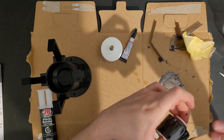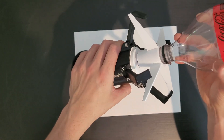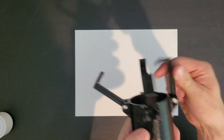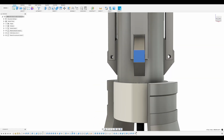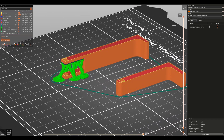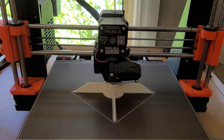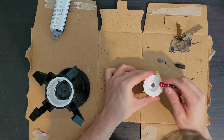I made the pressure vessel much shorter — it now sits mostly inside the PVC end cap, which should help stop air leaking through the layer lines. I also replaced the TPU seal with an o-ring. The rocket should be able to seal and push up into the hold-down arms without becoming unsealed like the last version. I made the base shorter and smaller, and the hold-down arms got moved to the stand, not the pressure vessel. The mounting arrangement got swapped around too — on the first version the screw attached to the centre of the mount with the arms on the outside. Moving the arms to the inside made them print without support material, they are stronger, and allowed me to nest the screws inside the stand — they kept getting unscrewed last time. I also printed the fins separately from the body, as they kept warping at the tips when printed in one piece. I glued these in place and also added some super glue to the inside of the pressure vessel, hoping this would help seal the 3D print.